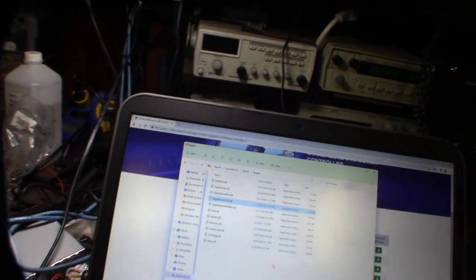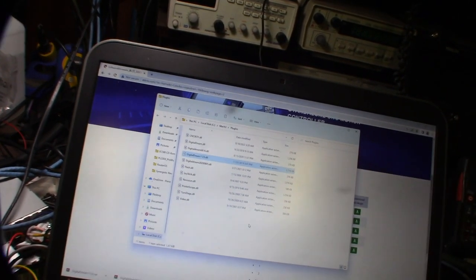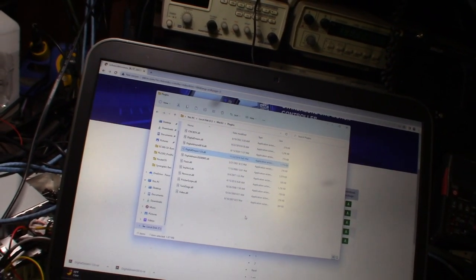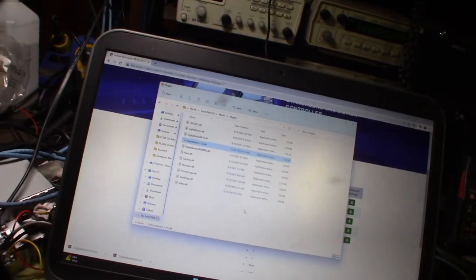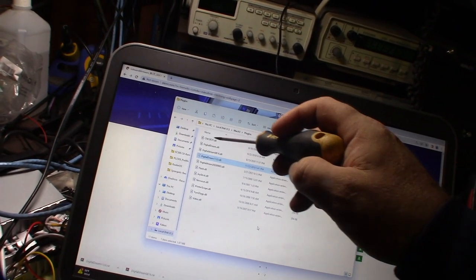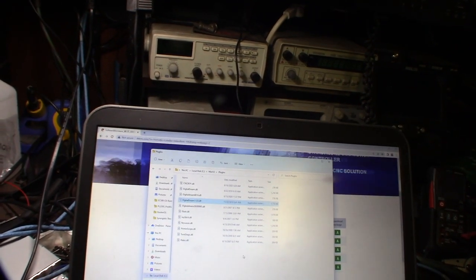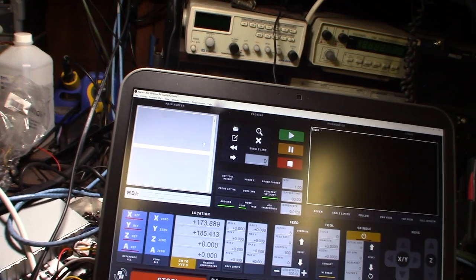A couple hours later, I've downloaded every single plugin I can get from Digital Dream. The 'CNC Boy' plugin makes me nervous. Maybe they statically programmed the IP - the new one's 192.168.4.x whereas the old one was 192.168.1.x. So the other plugins might be looking at the wrong IP range. I've asked the supplier for the XML config file. I've tried every single plugin and I really suspect that's the issue - only the CNC Boy plugin is pointing to the right IP address.